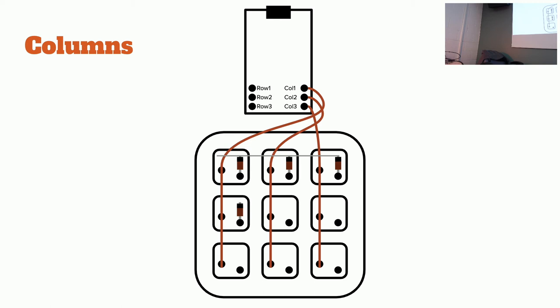So do I just cut off the diode? No. I would heat it up and then take the diode off. So grab this, heat it up and pull on it. Then you'll have the diode off and can pull out the switch, before you add the column to it. I'll go grab you another switch. There you go.